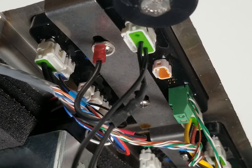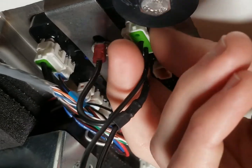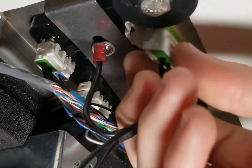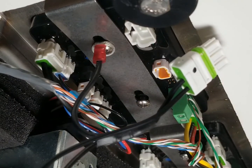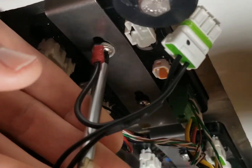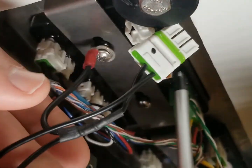The first thing you want to do is disconnect the circuit board from any sort of power, and that's going to be your long extension here with a little ground on it. There's just an underside connector you can get with a finger on this three prong connector - it just pops right out. Then you're going to take your Phillips screwdriver and back that screw out.